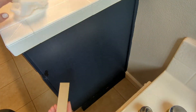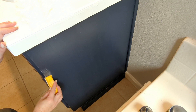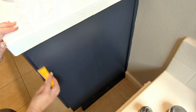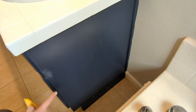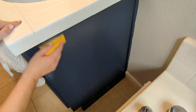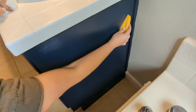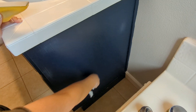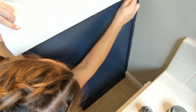I'm starting out with this little micro sander, trying to just patch some places first — just scuffing up where I'm going to repaint. There are another couple of places over here. I'm just roughing up the surface of that old top coat to make sure that my paint will stick to it, and then using a cloth to wipe off any of the dust that creates.